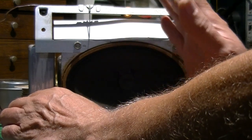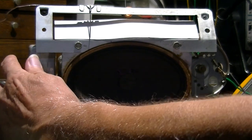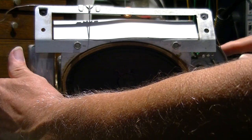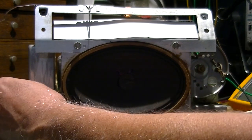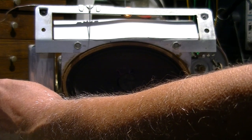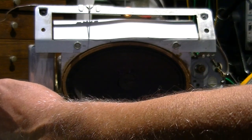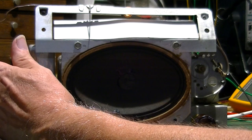It's a little awkward because when you align it - naturally I didn't redo the IF transformers since they were already done. But when I got the new tube I did readjust the oscillator and antenna alignment. The alignment procedure is: sit at 1600 kHz and adjust the oscillator, then go to 1500 and adjust the antenna - that's it. You don't align at 600, but you put your signal generator on 600 to verify you get modulation there, and I got it this time.